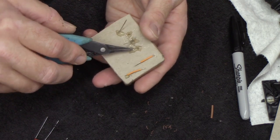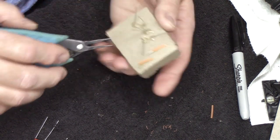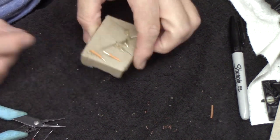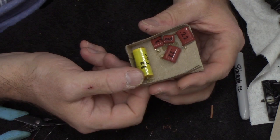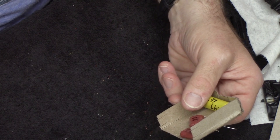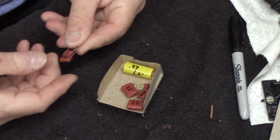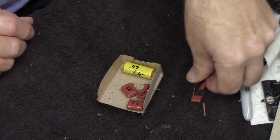Now these are all glued in. I'm just going to bend them a little bit so the ones that need to be separate are separate. This does not have to be fancy. I've installed five — two more to install and those two share a terminal. Those are the .03s. These two capacitors need to be safety capacitors — they are going from line to ground. They don't have to exactly be .03, they just need to be safety capacitors in that neighborhood. Let me go get a couple of safety capacitors. I'm glad I caught that before I put those in — I just wasn't thinking.